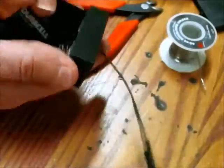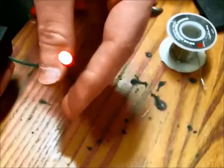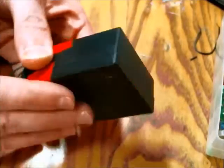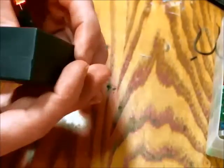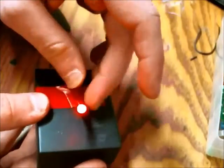Let's test it out. There you go — you have your LED light. Now let's put it in the pumpkin and see how it looks. Prior to putting the light into the pumpkin you want to make sure that it's sealed and somewhat water resistant, because it's going to be outdoors and inside the pumpkin so you don't want water to short out anything. I'd also recommend mounting the LED onto the battery enclosure so it can be adjusted to a nice angle to illuminate the face or pattern.